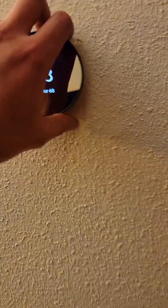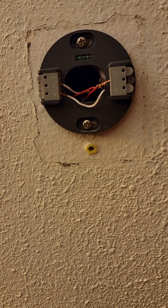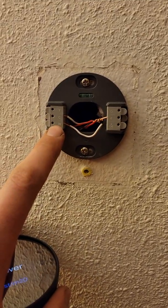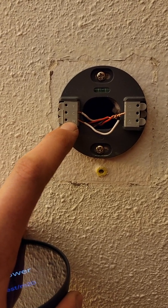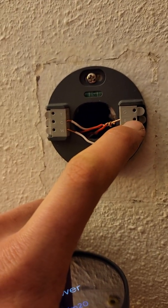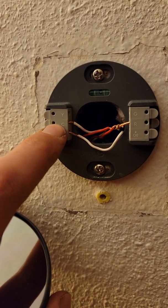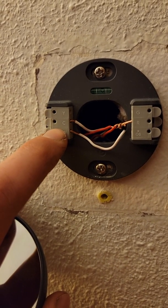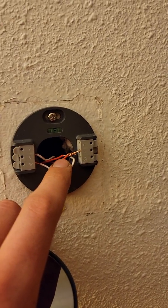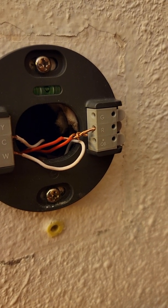After you run both sets of wires into the thermostat, W for white is the white wire coming from your pellet stove, R for red coming from your pellet stove. For the transformer, it comes with markings on one of the wires — it has a black stripe, so I made that one the common. It shouldn't matter because it's a transformer. Then with the other wire (the red one), I grabbed a pair of needle nose pliers and wrapped it tight around there so it's not going anywhere, and it works like a charm.